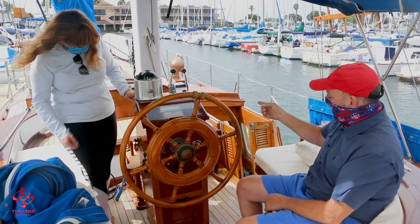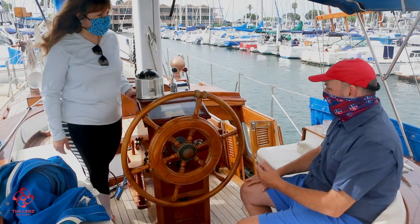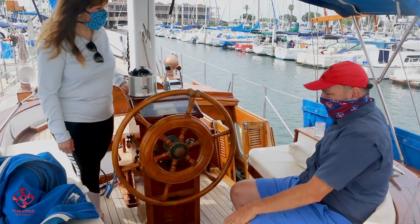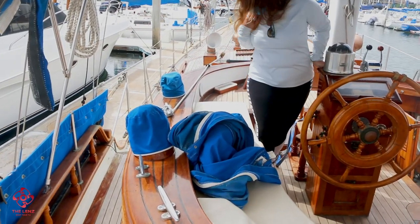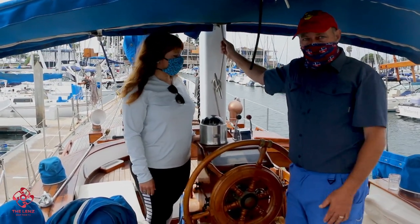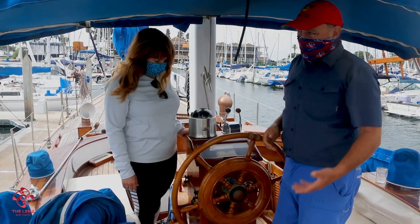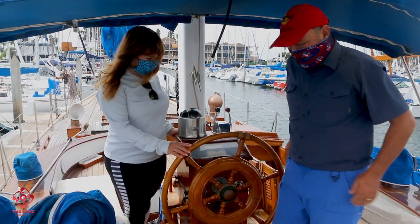We control our sails from the winches — we've got our primaries for the jib, the main winch over there, and the mizzen sheet is right here. We don't need a winch for the mizzen; I've got a five-part block and tackle. So even if it's blowing pretty hard it's still manageable — just one less piece of equipment we need. Is it original to the boat? Yes, all of this is original — nothing's really been changed.